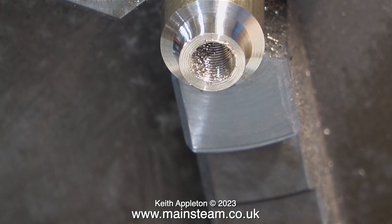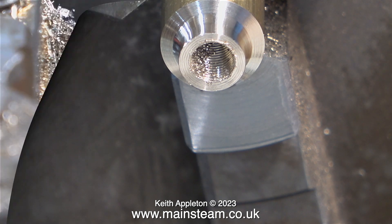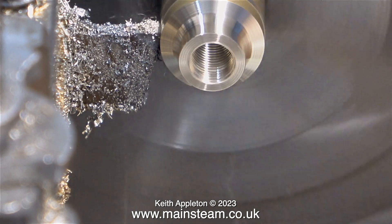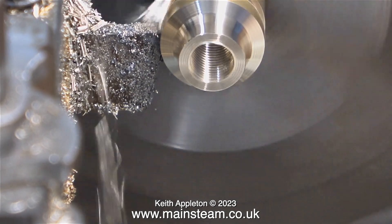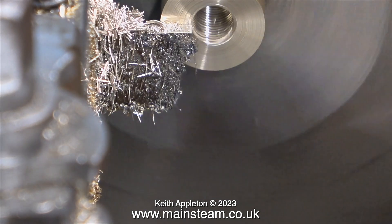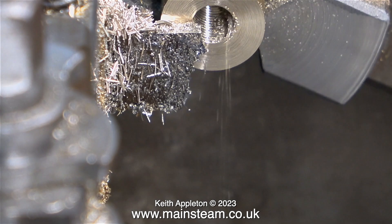After turning the piece of brass to the shape I need, I thread the hole down the centre — once again quarter by 40 threads per inch. Now it's time to part off the finished component. I'm turning this part completely freehand. The hole down the middle is quarter by 40 threads per inch, but the rest of the measurements are totally unknown — I just looked at the part, and when it looked right, it was right. In the next episode I will discuss tool setup when you want to duplicate parts you've already made which are not turned to any known dimensions. Another way would have been to turn the part round in the chuck, keep the original round nose tool setting and turn the other end the same.